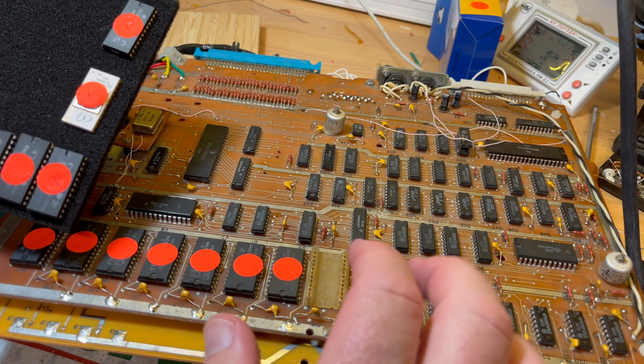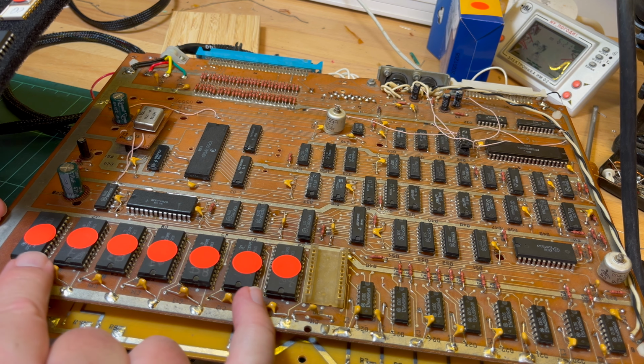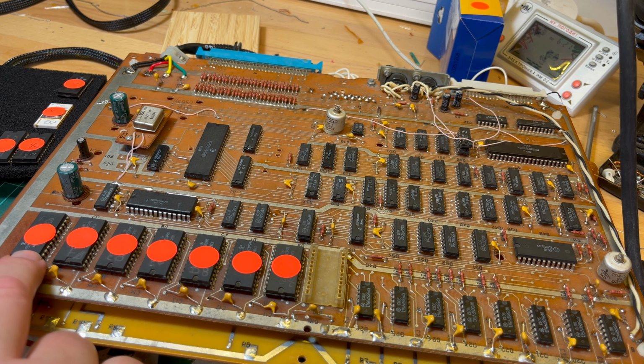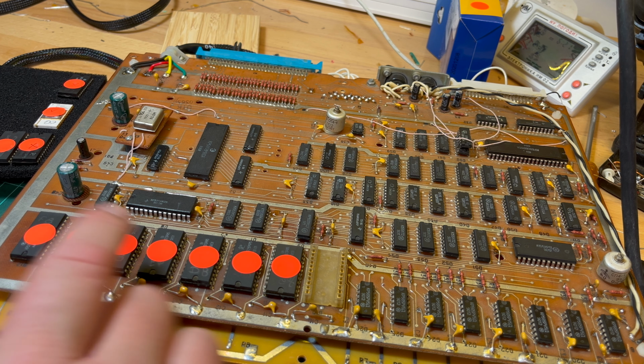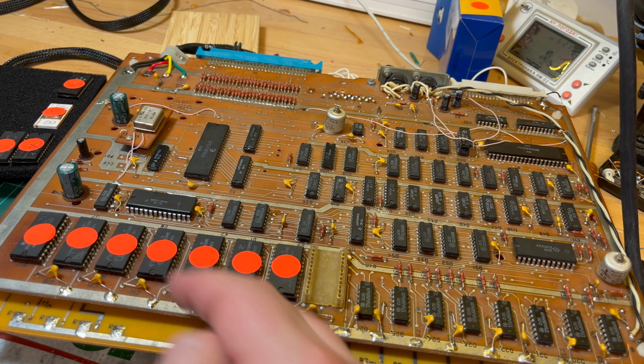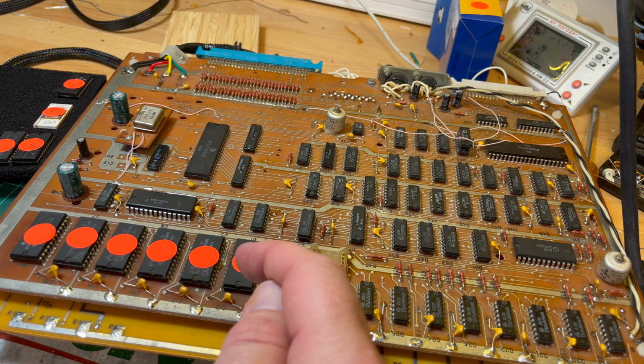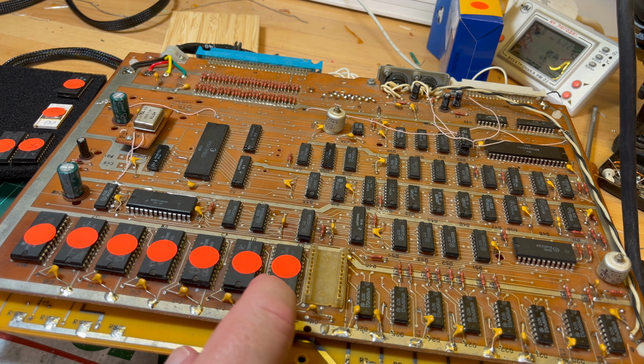The other thing is, can I put in a 16K, say, a 27128? Could I just put in a single 27128? I'm guessing, how would you do it? I'm assuming there's a chip select line or output enable or something. So you would use that as the additional address line on a 2716, I guess. So it's active low, so you'd have to invert it, I guess. So if it was active, when chip select is low on this one, actually we're going that way, aren't we? So low address to high address. Yeah, anyway, I'm just thinking out loud.